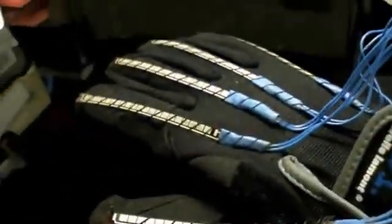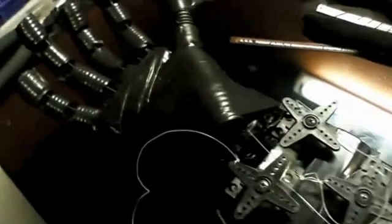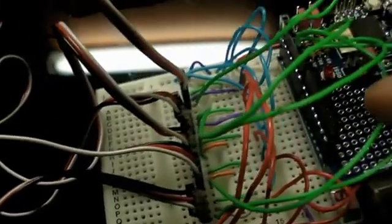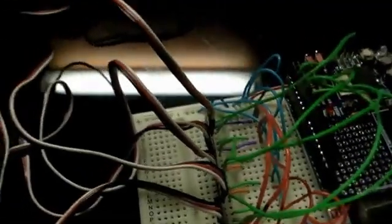From here this sends out whatever the corresponding finger angle to the corresponding servo on the animatronic hand. I have five servos — just simple hobby servos, they're Parallax. It's a mess of wires, but just ground, voltage, and then the control wires to send the servo to the correct angle.